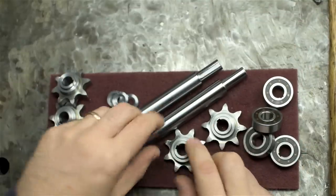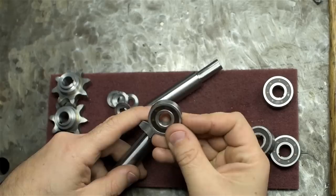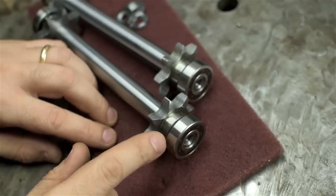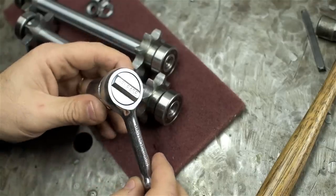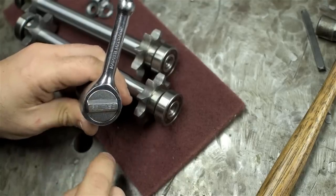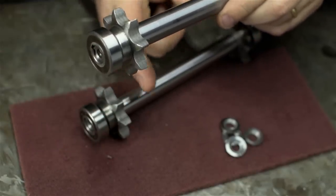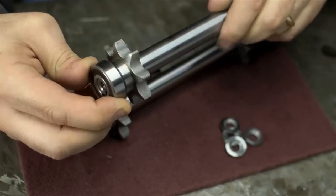Two of each of these fit on a shaft, followed by a bearing — though these are actually clutches, or one-way bearings, sprag clutches. They look a lot like bearings, but they only spin in one direction. This type of bearing, or clutch, is used to transmit torque in one direction only, not the other. In this case, specifically, they're used to hold a load from moving backwards. Think of them sort of like the ratchet in the head of this wrench — easy to push the handle one way, but if I let go, the handle doesn't fall back down. I can only apply torque in one direction, not the other. Here, they're being used to hold marbles. The sprockets will have a chain connecting them. There'll be some sort of marble carrier array linked to that chain. As it turns, it can lift marbles. When the motive force stops, the marbles can't back drive — they can't roll backwards. They can raise, but they can't lower.